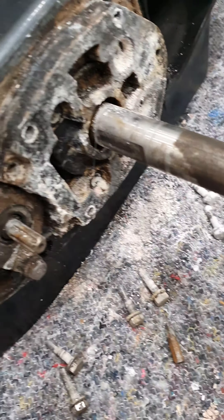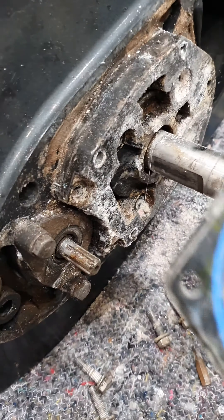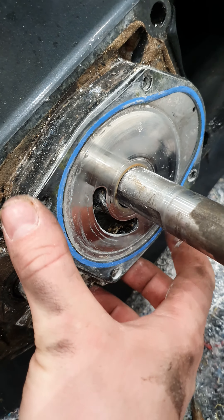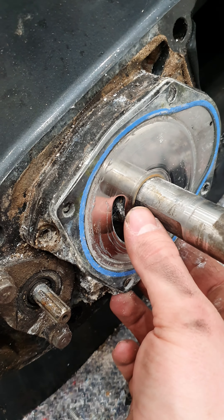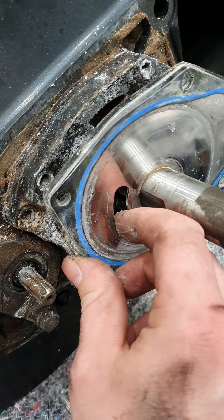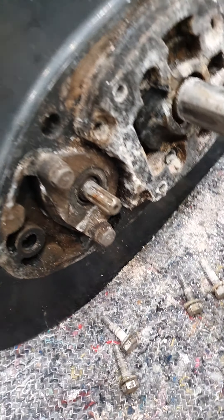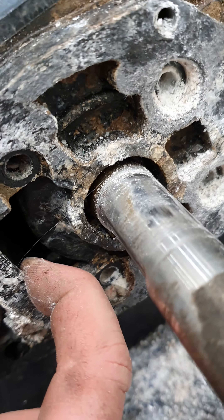Before I take the rest of the unit apart, it's useful to show you some of the elements and how it works. Looking at the water pump, you have a seal with a gasket which sits between the top of the housing and the bottom of the housing. There you've got the locking pin or key which holds the impeller to the drive shaft. When the drive shaft spins, the impeller spins as well, drawing water in through that hole. Taking off the gasket on the bottom, you've got the water intake that feeds up and comes through this hole here.